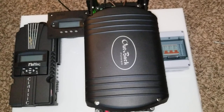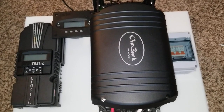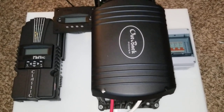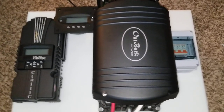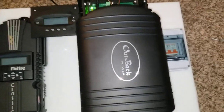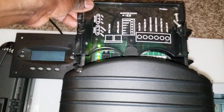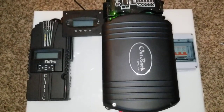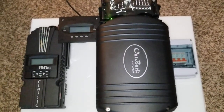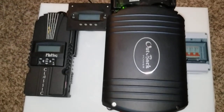This is how the system looks right now. You can hear the fan running really high, cooling itself down while charging the batteries. It doesn't come on unless some components inside are already really warm. This cover is supposed to go right here — I'm going to screw it down because I don't want anything touching or falling into the terminals and causing arcing in the system.